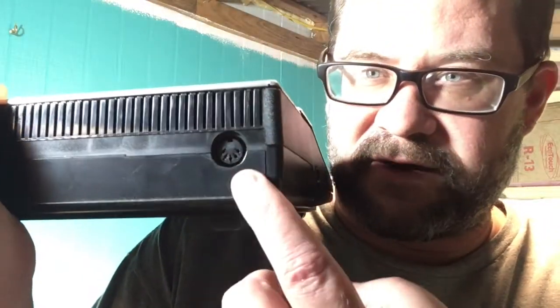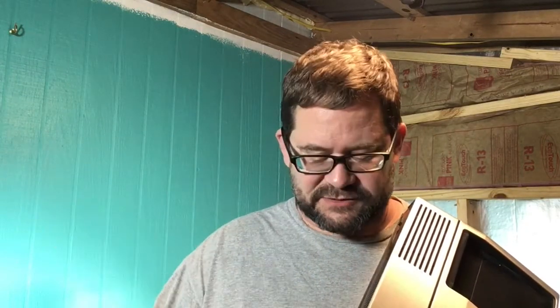The video signal on the TI-99/4A comes out here on this 5-pin DIN connector, and typically it will go to an RF modulator and then into the coax of your TV. The signal is kind of dirty, and a lot of people don't even have that connector on their TV, so it's a lot easier to just connect to AV. Let me set this off to the side and I'll show you what we got.